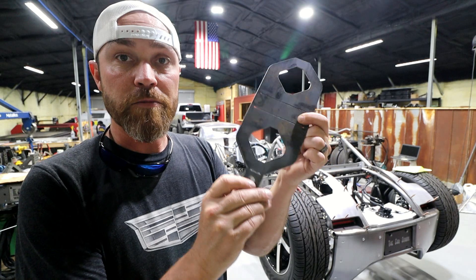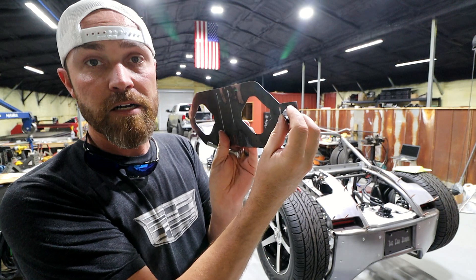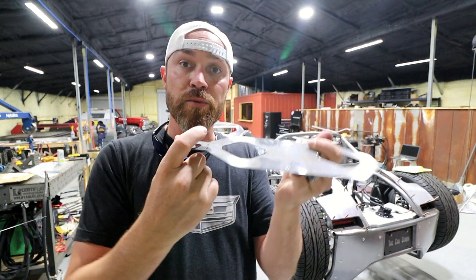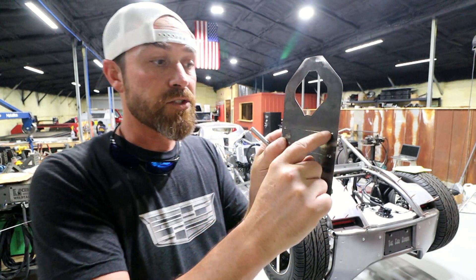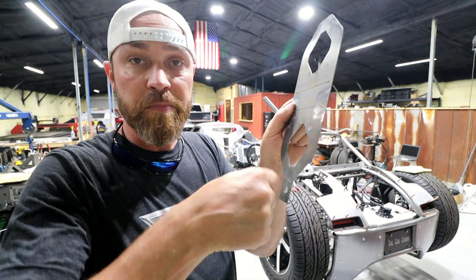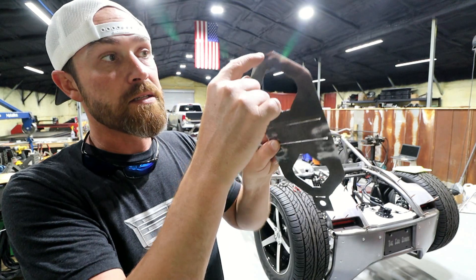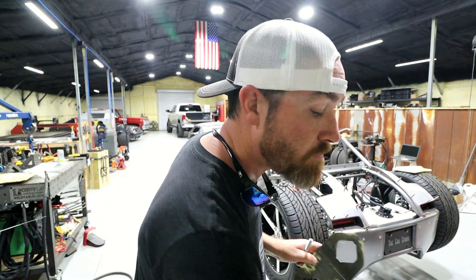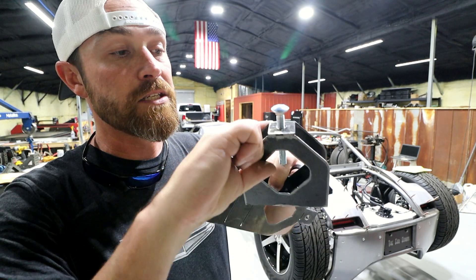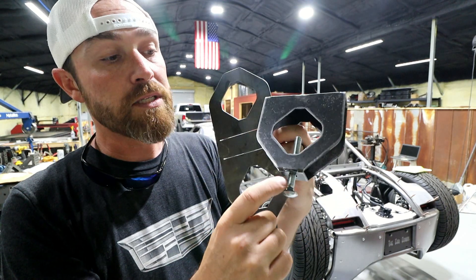Say you want this to be the outside of your tool — you're going to weld a nut on the inside to center it up on this hole, kind of tack that thing in there pretty good. Once you get it tacked, you can basically bend these over by hand on all these relief cuts — there are three of them: bend here, bend there, bend right here. You could use pliers if you wanted to. Once you get that thing all the way wrapped around, you're going to weld this piece to this piece here.